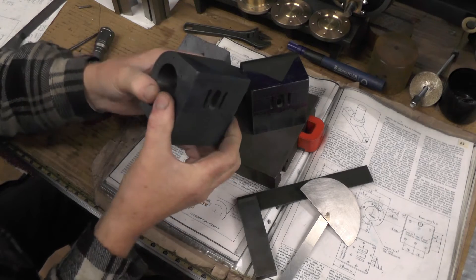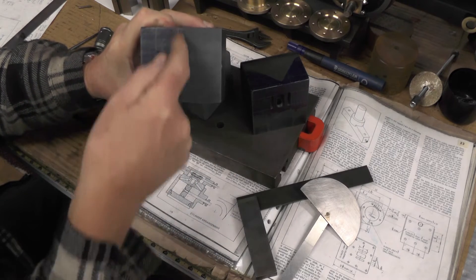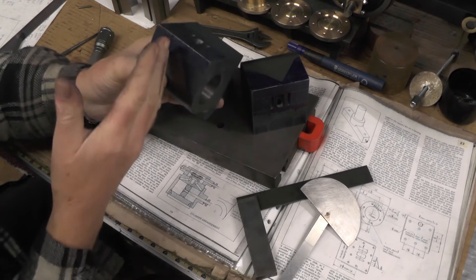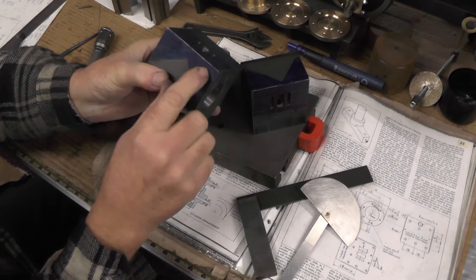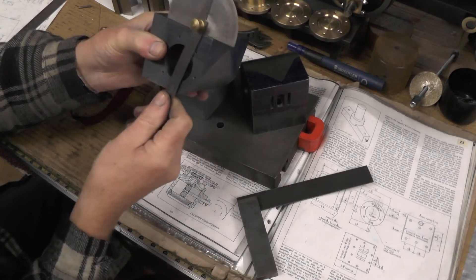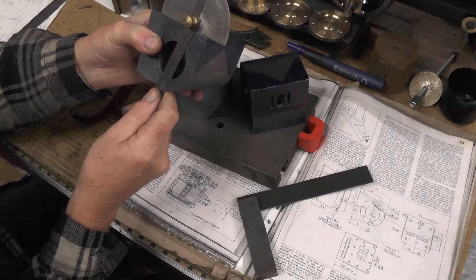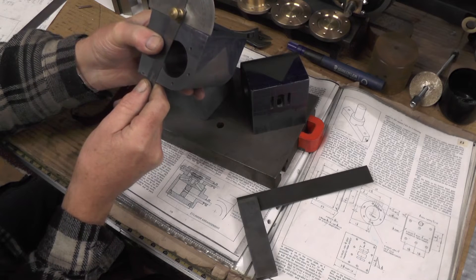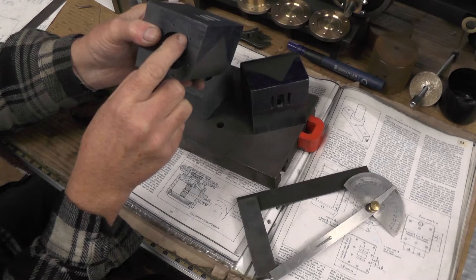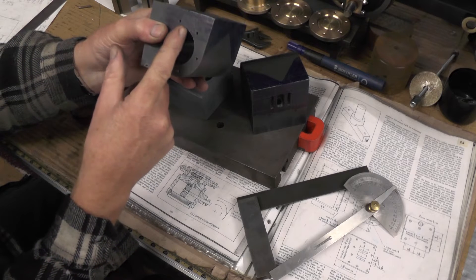Just to visualize where that slot is, I've come off with all my lines where the slot is - that way, that way, this way. I've put the depth of the slot in, and then where these lines intersect on this face I've drawn two lines at 12 and a half degrees to project downwards, and that's telling me where my drill is going to come in.